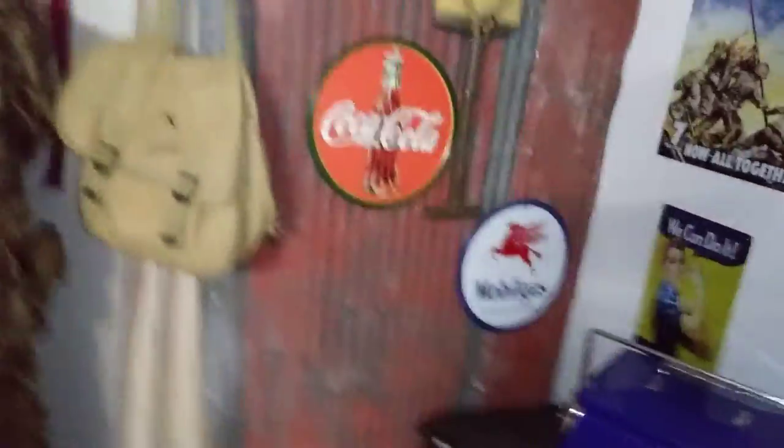I just want to give you a quick look — behind this canvas here you can see what I did: I built the frame, built the top to it, built the back, and then I skinned it with pallet wood. The reason I skinned it with pallet wood was for two reasons: one, it's free; two, pallets are plentiful. But I also knew that using such small wood for framing, the pallet wood would make it more rigid and more sturdy so I can stack my stuff on it.